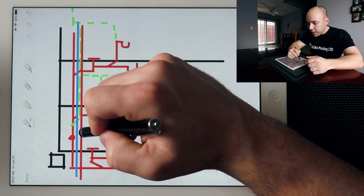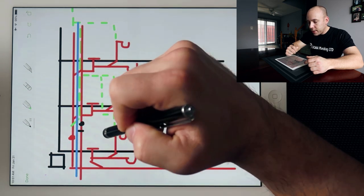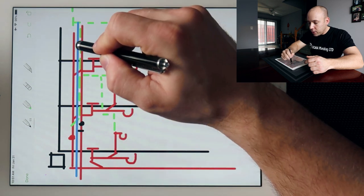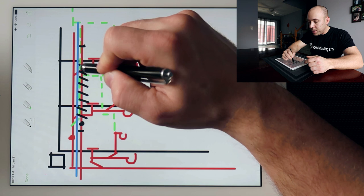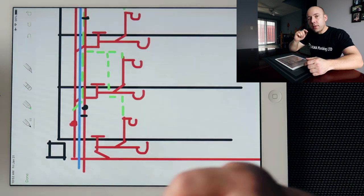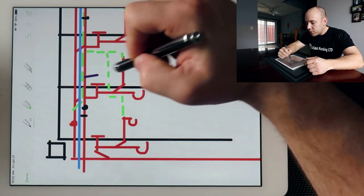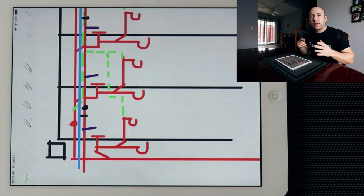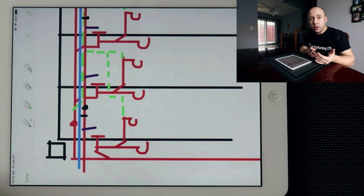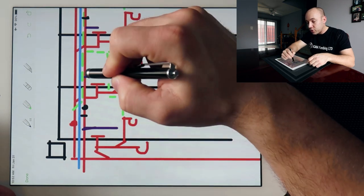And what we're doing is we're cutting the pipe just around this area because there was a pinhole leak in this section, and we're changing it all the way up to this floor right here. So this pipe is going to be brand new by the end of this video. And the way these risers work, as they go through the floor, they actually branch off and start feeding all the fixtures on each and every one of these floors. So that's why you're gonna see some T's that we're including and some 90s that we're including, because we have to reconnect to the branches that are supplying all the fixtures on that floor.